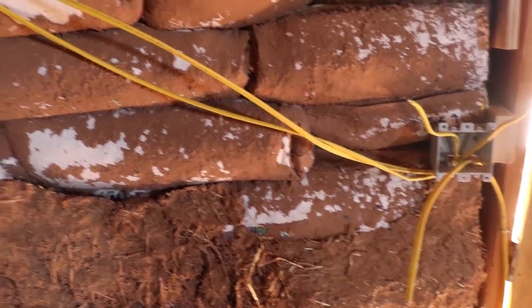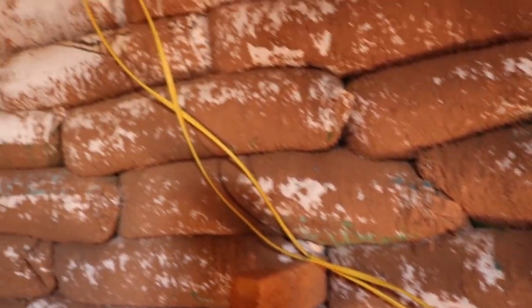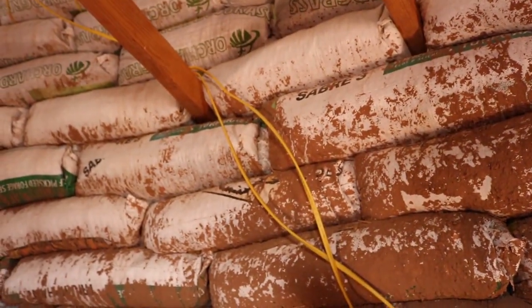Another observation people made is running these wires diagonally like that. In a house, you probably wouldn't want to run wires diagonally. It's going to make the wires a lot more difficult to trace, and if it's too difficult to figure out where it is, when you're putting in nails or screws or something like that, you can hit the wiring. And I wasn't crazy about it either, but I wanted to make it as short of a run as possible and use less wire. That's not really going to be a concern anyway, because we cannot put screws and nails anywhere we want to in this.